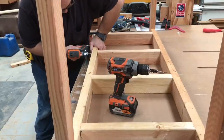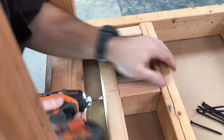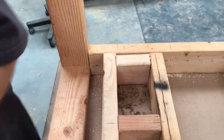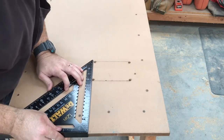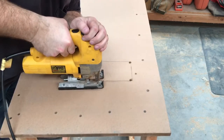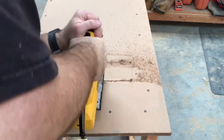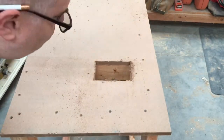We're going to put some cross bracing underneath the top. This will help strengthen the top and stiffen the frame, and it'll also give us a place to screw our lathe into. I've decided to mount the motor underneath the bench, so I'll have to pass the belt down through a hole underneath the lathe. I've framed out the opening for that and I'm marking the corners with the drill bit. Now I've flipped the bench back over, connecting the dots using my square, and with my jigsaw I'm cutting this opening out — perfect alignment with the blocks we put in.